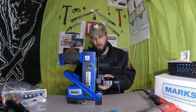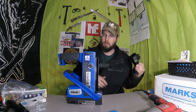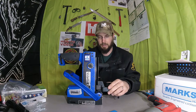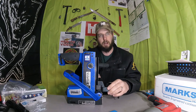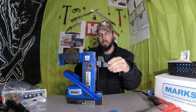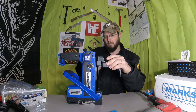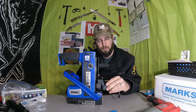Let's say you need to scope your hole — the whole drill assembly comes off. Boom, scope your hole. You don't need to remove the entire mag drill. Slide it back on, tighten it up, and you're good to go. Also, look at the adjustment in the throw — if I have a small drill bit and need to drill a small amount, I can set it all the way at the bottom. Once you're through that, let's say you're doing a vault door or something that requires much deeper penetration — look at how much throw we have. I can change the distance and still have full throw through the mag base itself.